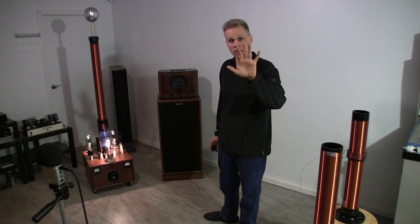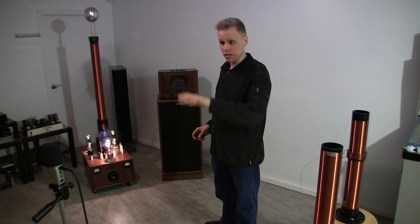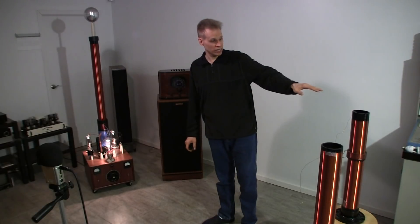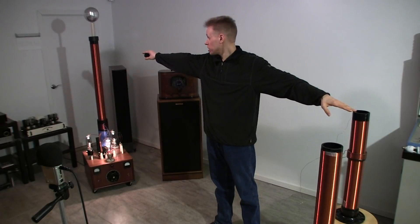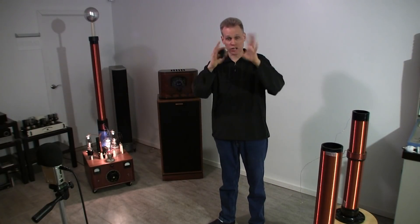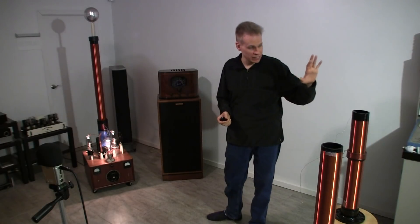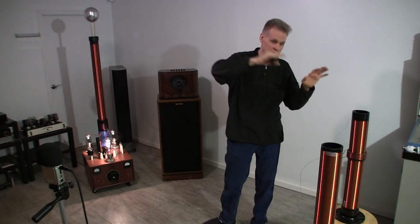Alright, I think we're ready to go with the demonstration. I have the camera set quite far back and also the microphone sitting far away from the oscillator so I don't damage them. I also have a wide angle lens on the camera which might be a little deceiving, so I'll show you the distance between the coils. With my finger on the top of this coil and stretching out my hand, the other coil is about nine or ten feet away. The distance is really just what fits in the shot — I could move it quite a bit further away and get the same effect. What we're doing is we're going to look at resonance — I need to make these coils very electrically similar to this coil here so that this coil will transfer some energy into those coils.